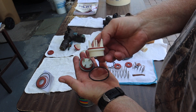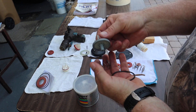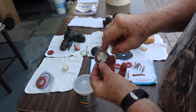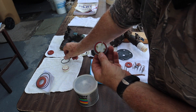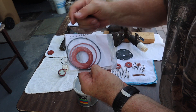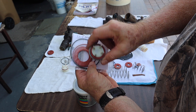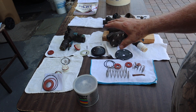This particular set of parts goes to a different brand or model of pressure vacuum breaker, like this one or this one. This one goes to a whole different brand — it's a Watts 800 M4. This is another Wilkins. This disc — you pull it out and it will sometimes tear. That's actually what happened with this one, which naturally sits on a much bigger, two-inch backflow valve. It wore out and started to fail.